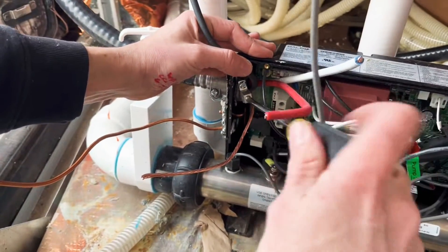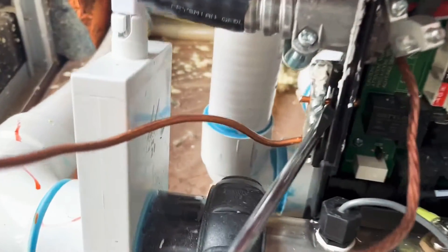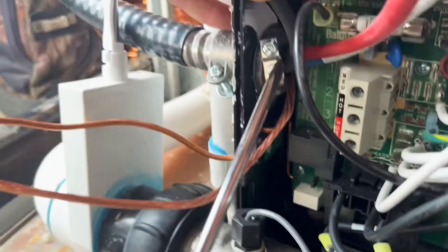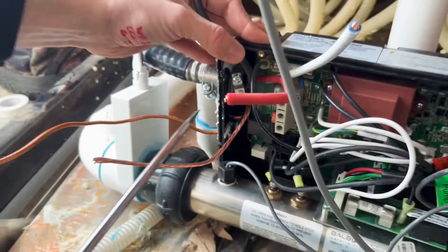I'm going to show you how you redo the bonding on here. If you look to the left side of this control, that's where it's going to want to come — it's got a little hole here. You have to bond this connector because it's in a plastic box, and then we've got to bond through here. I'll show you what it looks like at the end.